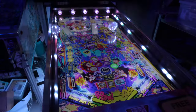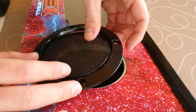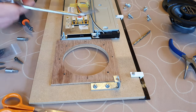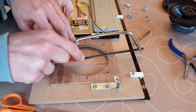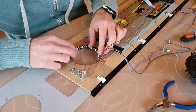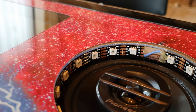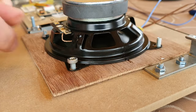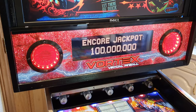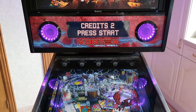I love these addressable LEDs so much that I'll also put them in the speakers. I grab the speaker panel and remove the speaker grills from the acrylic front piece, then remove both speaker drivers and flip over the panel to access the back. To feed the wires for the LEDs into the speaker holes, I cut out two tiny grooves into the raised section for the speaker drivers and pop out the middle section to make a channel. I then stick a small section of LED strip inside the speaker hole on both sides — the LEDs fit exactly in the hole and look really clean. I put the speaker drivers back in place, assemble the entire front again, and slot the panel back into the back box. I love how this looks — it really adds another extra feature to make the cabinet stand out.